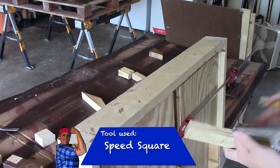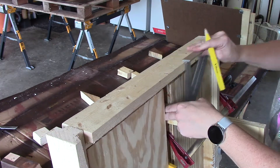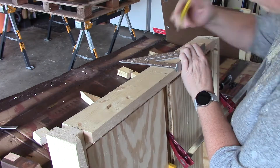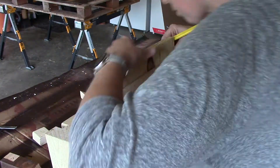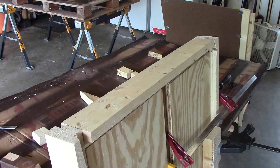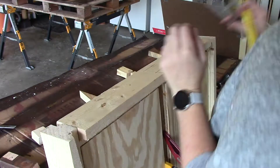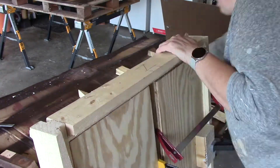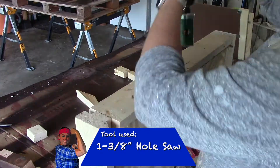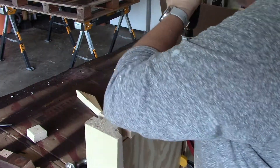Before attaching the final layer of plywood, I wanted to drill the hole in the frame for the pipe. It's a lot easier to line it up and measure it out when I can see the path that the pipe will go before putting on the top. I'm using a speed square to help transfer my lines up to the frame so I can make the cutout, and I'm also using my scrap 3/4 inch plywood to make sure I'm not cutting this hole too high or too low in the frame — keeping it exactly center.